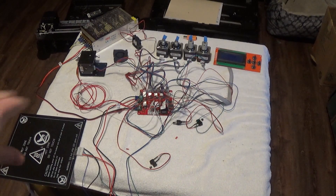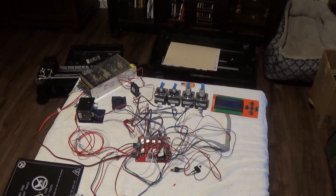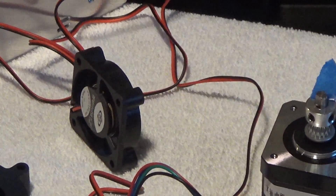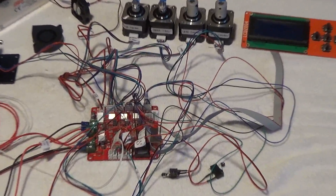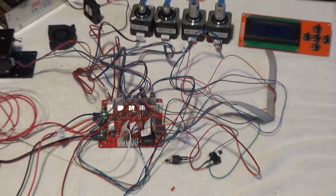All right, now we're ready. After setting everything up, we're ready to actually start testing electronics. I've plugged in my power strip and all I'm going to do is reach down and turn it on. There are three things we're going to test: we're going to see if this fan comes on, because it should come on automatically. If the power supply works, then we should have a screen coming on, and if the screen comes on, that means the motherboard is getting power and working properly.